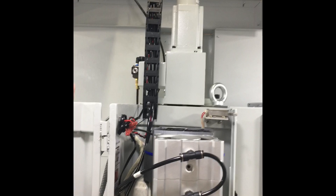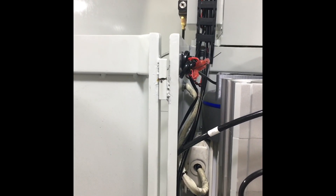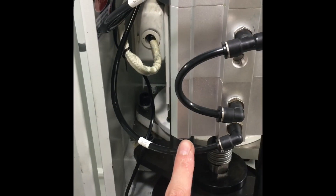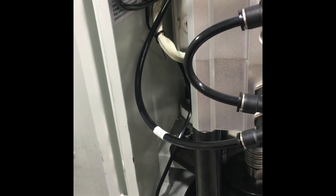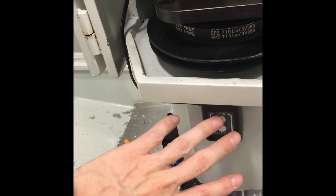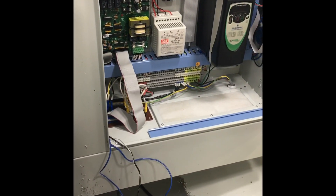The head is mounted and the wire harness is all mounted up. I put a zip tie on the rear standoff to keep the wires to the rear of the machine and got the line routed. I had to cut the air lines a little shorter — they were coming out too long. Take your labels, peel them off, get your angle and length, and cut them. Put the bracket up for the zip ties to hold the pendant switch. Take some brake cleaner to clean that off, press it firm, and that's really it up top.